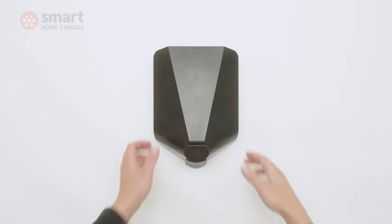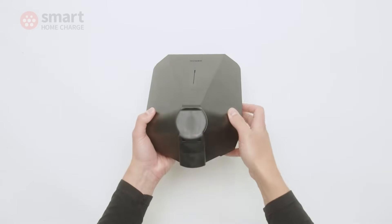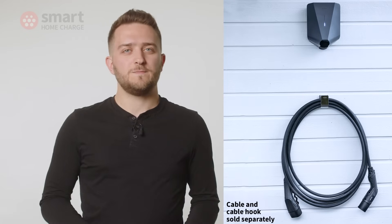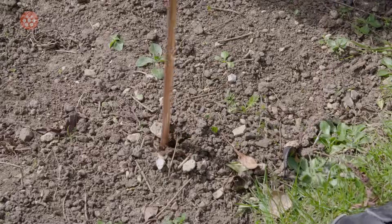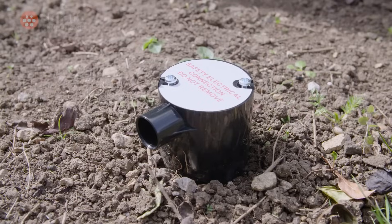The headline features of the EZ1? Well, it looks great, but the ability to operate as a tethered or an untethered charger is surely the ace up its sleeve. That means EV drivers no longer need to choose between the convenience of a tethered unit where the cable is permanently attached, or the flexibility of an untethered unit — you can keep the cable attached if you like or store it away. It also includes open pen conductor protection, which means a separate earth rod does not need to be installed, resulting in a simpler installation and a neater result overall.